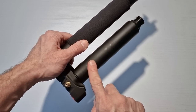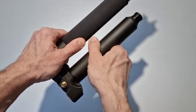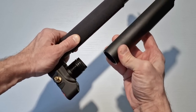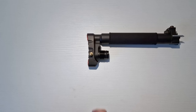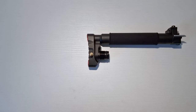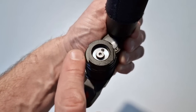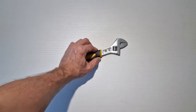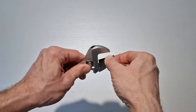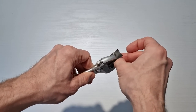As you can see, the magazine holders are already gone, the fuel probe is in place, so it's time to unscrew the air tube itself. Now, I'm glad that this coupling here remained on the M18 thread, because sometimes they do. You definitely won't be able to unscrew it by hand. Not a big deal though, there are those two cutouts to use a wrench on. I personally am a bit on the pedantic side, so I prefer to put some electric tape on my adjustable wrench so that I don't damage the anodizing on the coupling.